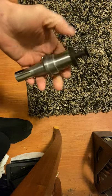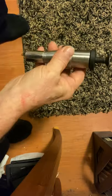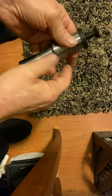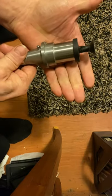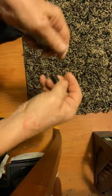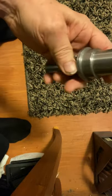This is a stub spindle on the spindle molder. Typically, spindle molders of the European class have removable tops, as they're referred to, where you can pull a spindle out and replace it. This one is a stub spindle, and you'll notice it doesn't have a nut and it has a center bore. Let me show you why such a spindle is useful.